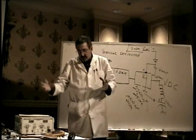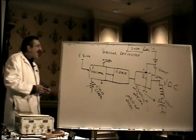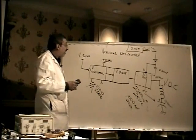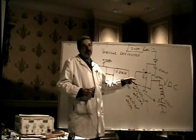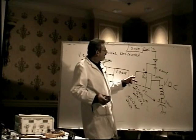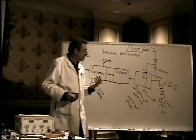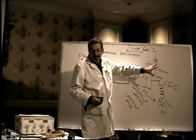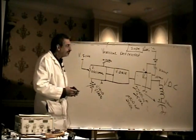Okay, that's a really critically important thing to know about how the vertical circuit works. And in general, that's typically what happens. I haven't ever seen this thing fail, so you can almost always assume, I hate to make those assumptions, but you can in this case, that you do have the drive to the chip. It's really not going to be anything back this way. You can pretty much guess that it's going to be in the output circuit where your problem really exists. Okay?